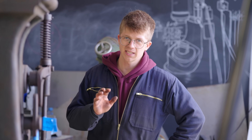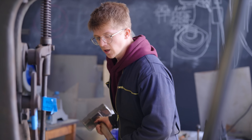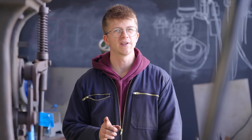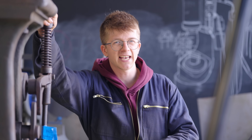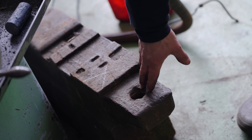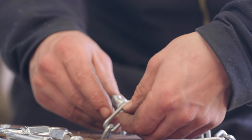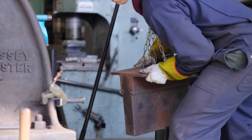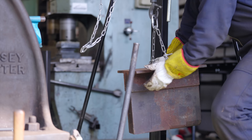We've had that torch cooking on the key the whole time. I have potentially a bruise or a broken rib, and swinging this sledgehammer is causing me a lot of pain — plus the sledgehammer is only 12 pounds. What if we could make a very big sledgehammer? Do you remember when we visited WH Tildesley? I saw them drive keys using a chain and a big massive bar of steel. We're gonna make a key-driving hammer. What if I swung this anvil at the key? There are ways I could get the ram block out without taking the bottom die out, but I know the bottom die needs to come out for a lot of refurbishment anyway, so might as well get it out.